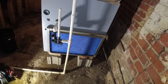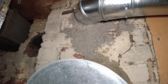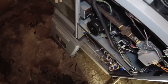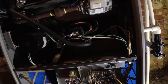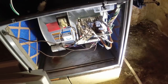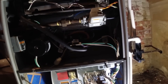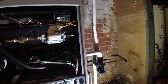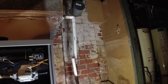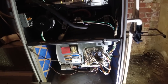The air conditioners for this unit are up on the side of the building. That's drying up pretty nice — doesn't look too bad. Basically this was just another check-out inspection. We had a couple of furnaces; we got the salesperson called — going to have them give a price on the furnaces, one downstairs and one upstairs. The one I don't feel is safe, and the other one I don't like the way the chimney is — it needs vented properly or a flue liner run. You can see this chimney's got cracks all the way down through it — it's deteriorated. I'd guesstimate the building is at least 100 years old. That's going to wrap this one up — if you enjoyed the video, give it a thumbs up, subscribe, and check us out on Instagram and Facebook.